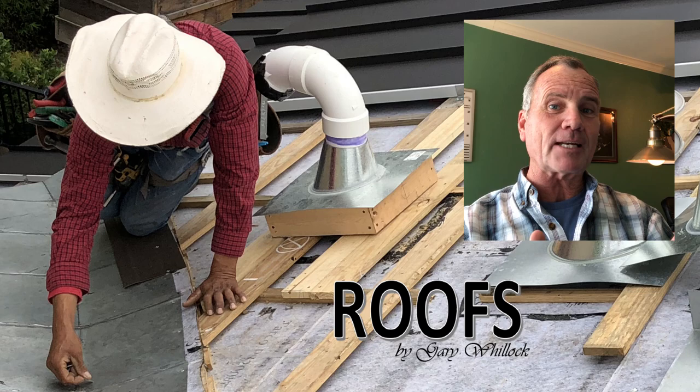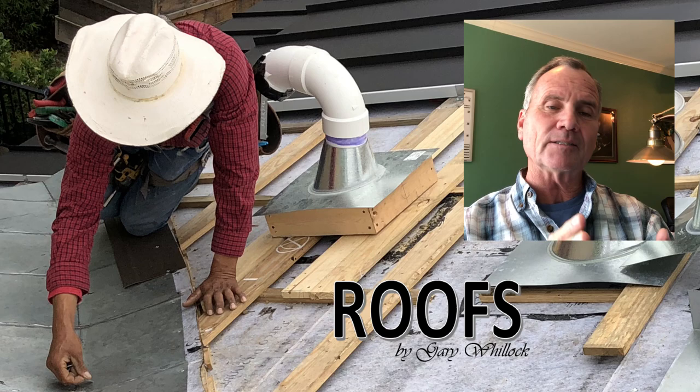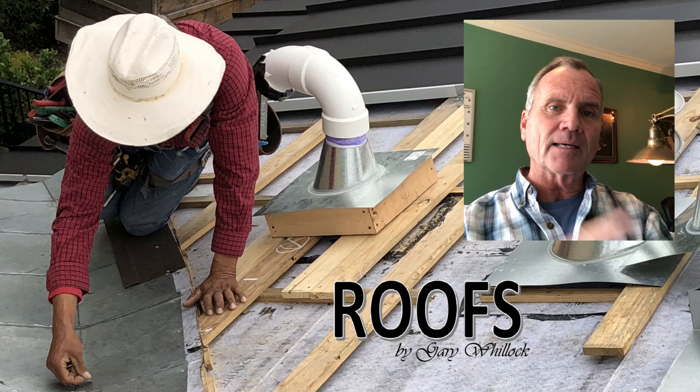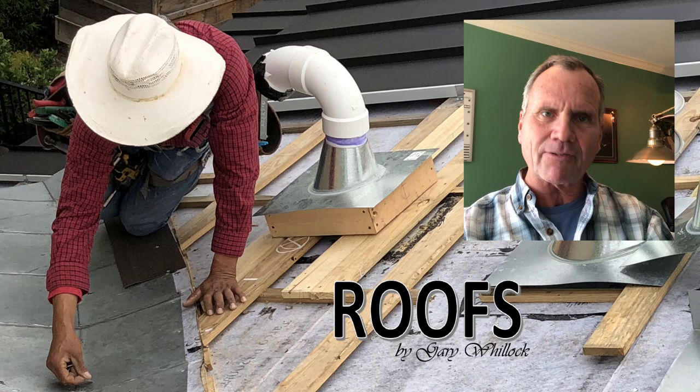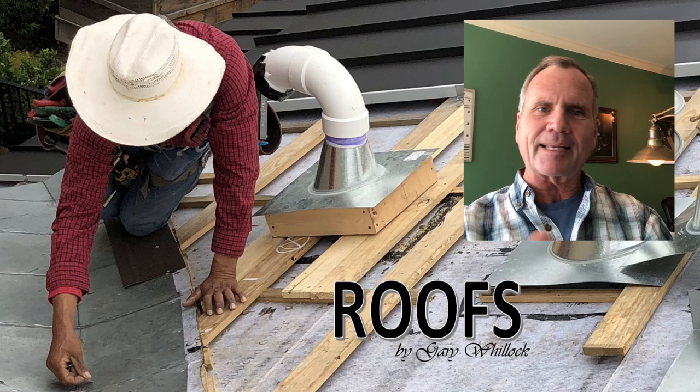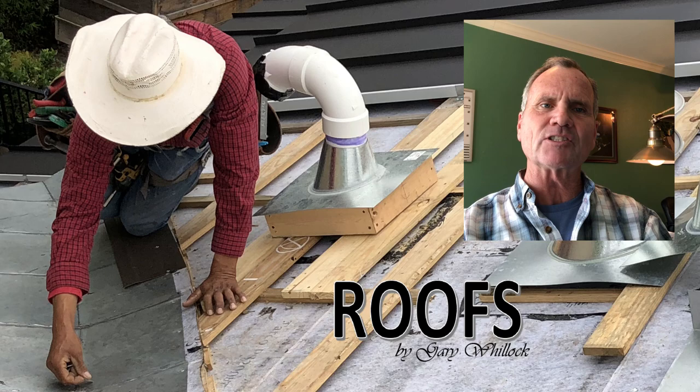Hello, I'm Gary Willock. Today we're doing this video a little bit differently. As you can see, I'm sitting in my office. I've already been out on the job to film the guys doing a split sheet panel with a pipe flashing sandwiched in between. We call it a split sheet application. It's the most watertight and most lasting way you can install a pipe flashing for a metal roof. What you see him doing right now is simply cleaning off all the little debris, making sure nothing is there before they start the process of installing the first split sheet panel. They've got three in a row that they're going to do.